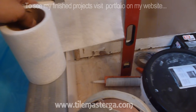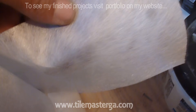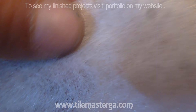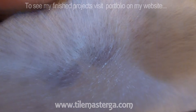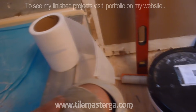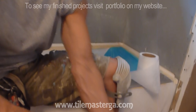I'm using only this type of tape — I'm not using drywall tape or anything like that, because the drywall tape has much bigger holes. Here you can hardly see any holes. This is a nice product, and once the membrane is applied and dried, it hardens and makes this really water resistant. Let me slowly move forward with the installation.